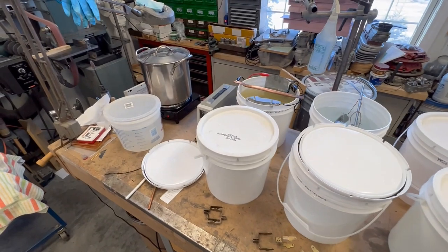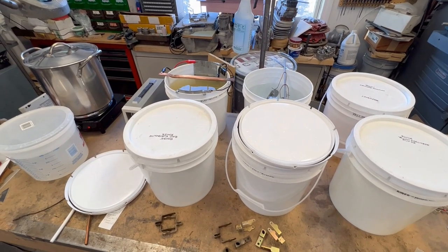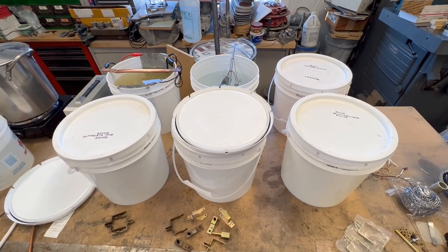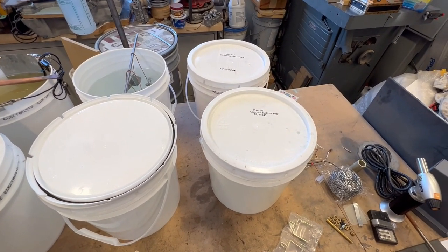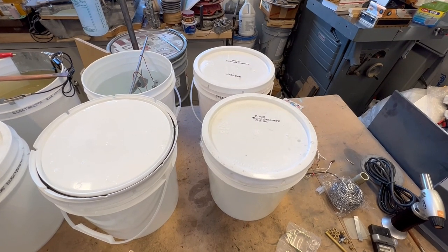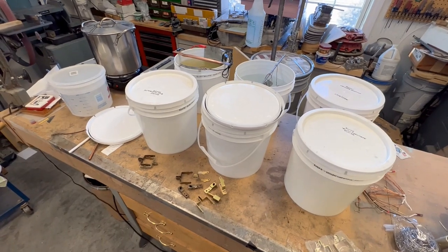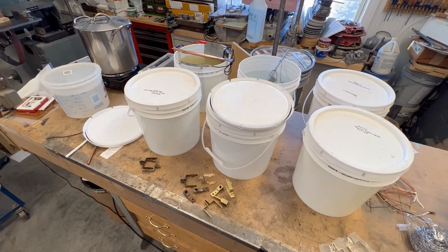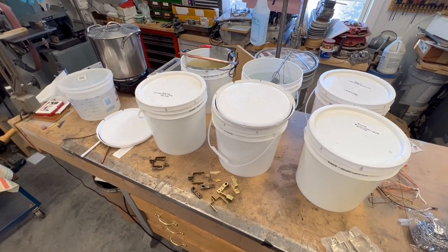As far as the chemicals: the degreaser is benign - any degreaser works. For the electrolyte you can use white vinegar, though I use a solution that works a little better. The hydrochloric acid solution is pretty benign - you can dilute it and put it down the drain. The only thing to treat with more respect is the chromate. It's fairly dilute and we've got hexavalent chromium - made famous by Erin Brockovich - but drinking it for 30 years versus just having a gallon and a half in your shop are two completely different things. I also built a little barrel plater that fits in the electrolyte bucket so I can plate all the little hardware like idle screws in bulk.